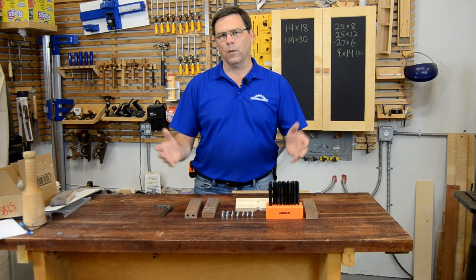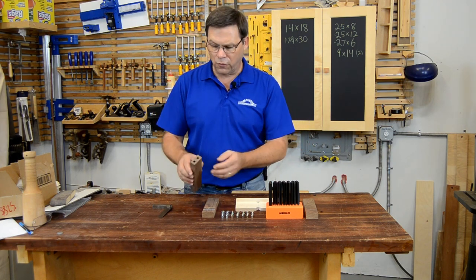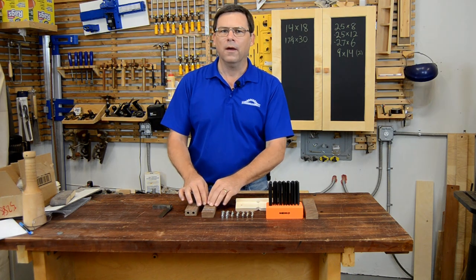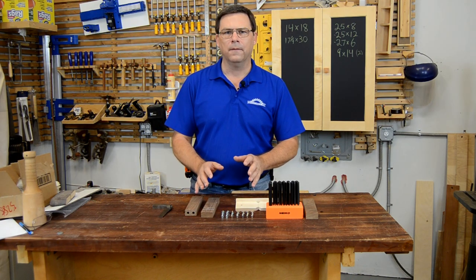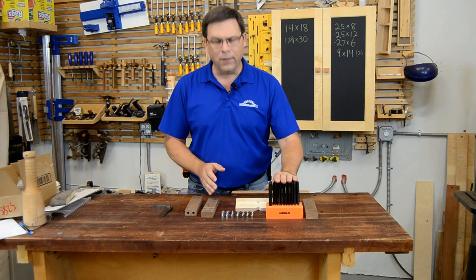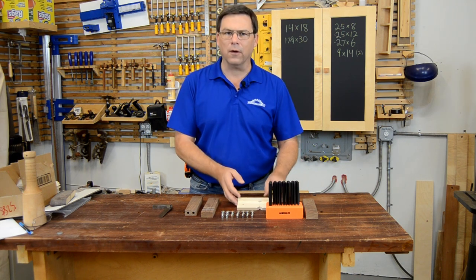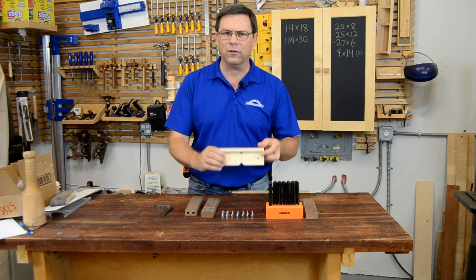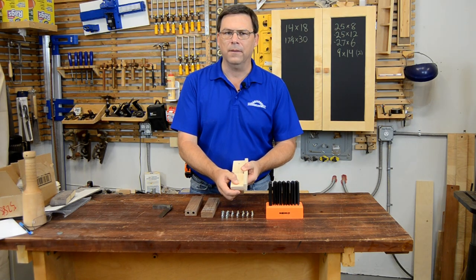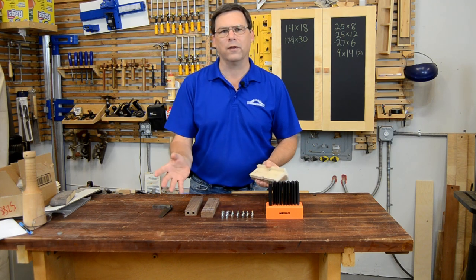In various episodes of our Woodcademy TV show, you've seen me use dowel centers to transfer holes from the end of one part into another, and they work awesome for that. But there's another option for transferring holes, and those are transfer punches like these, which allow you to transfer when there's a hole through a piece like this jig to mark another piece underneath it. So let's look at how they differ and why you would choose one over the other.